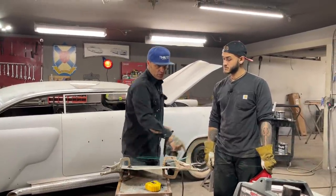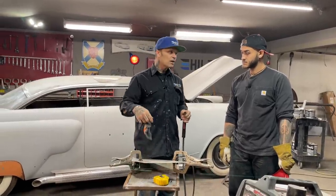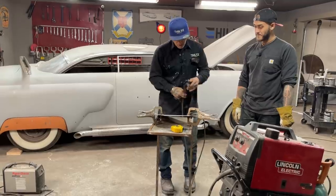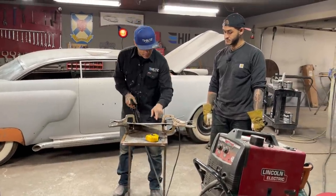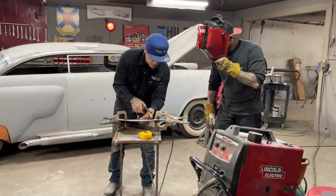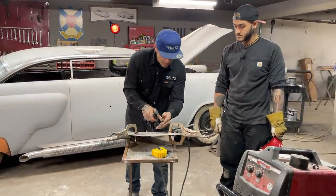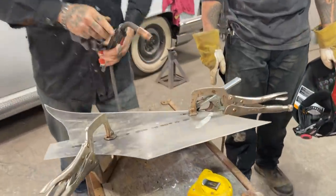with the helmet on, so he can make adjustments to keep the welder far enough away to make a good spot weld. At the exact same time, you have to keep in your head how long you're pulling that trigger each time. And you'll get to watch the metal being melted together. As you go along there, spot, spot, spot, spot, come back and put it, I showed you when you put your helmet on, I'm gonna close my eyes, I'm gonna weld, okay? I'll get you to go across there and do a bunch of spots across there. Then when you come back, you put your wire right there. Okay. Right, so you can overlap that part.